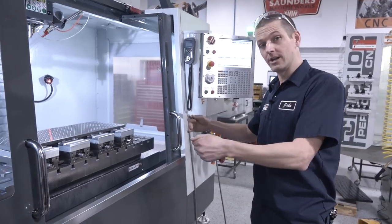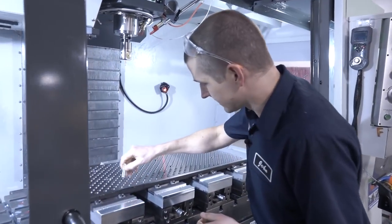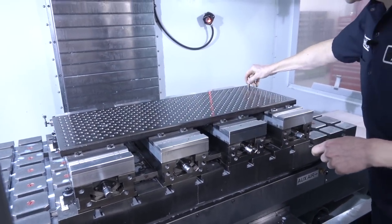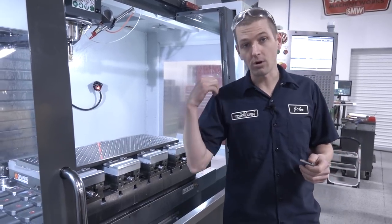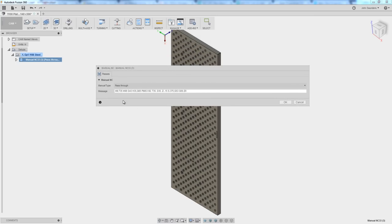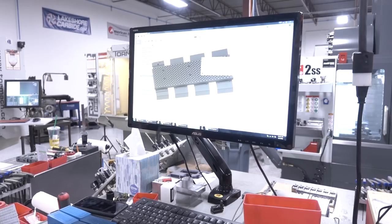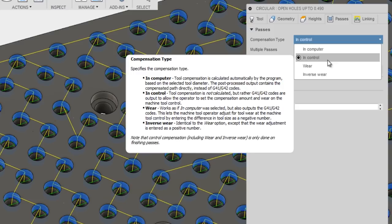One of the keys to a really good consistent bore diameter is the pre-bore diameter. We check it with a set of gauge pins and we're looking for a consistent fit from the first hole all the way to the last hole. We're trying to hold well under a thousandth of an inch of tolerance. One of the ways we do that is before the tool runs that operation, we have it actually do a cutter comp update. So in Fusion 360, we've got a manual NC pass-through that calls up that tool number with a Renishaw P985 with certain variables that have it automatically go down and re-measure to update the Haas diameter value for that tool. And the Fusion 360 operation is using cutter comp to compensate for that tool diameter.